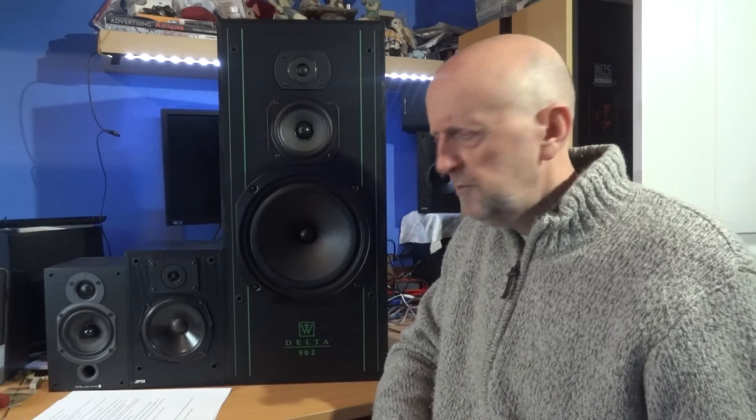Today I'm going to talk about this little circuit that's helped me out here. It's not much to it to be honest - it decreases the mid-range, because there was a bit too much mid-range in this speaker since it's not the proper speaker. But it may also help people with just a two-way speaker where you may want to tone your tweeter down, or even increase the tweeter just a little bit, depending on how your crossover is wired.